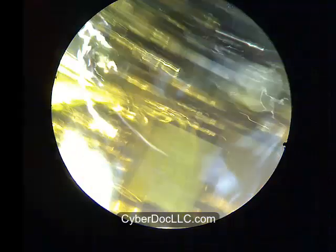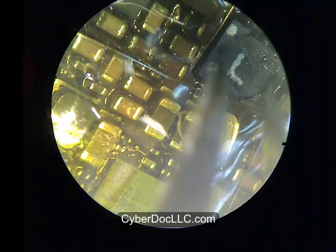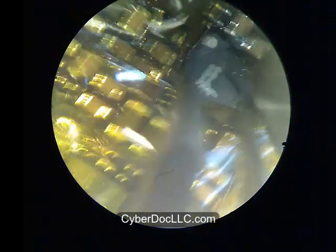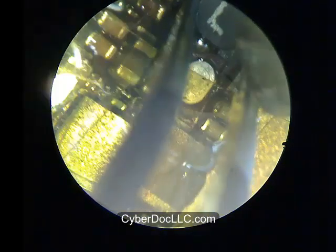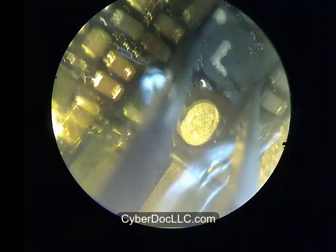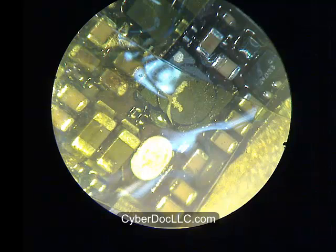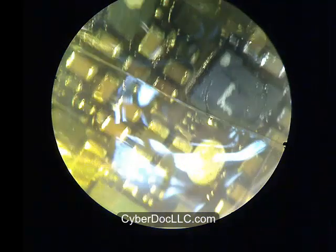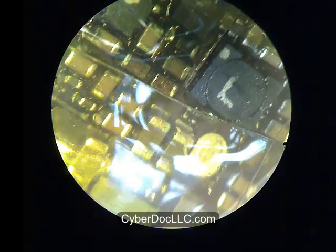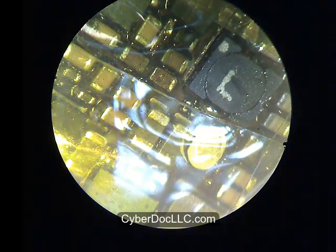Always supply flux. Once the flux is dry, you are running dangerously at higher temperatures than you want for the solder to flow, getting into the range of damaging neighboring components. Flux serves almost as a temperature buffer to absorb excess kinetic energy from the heat gun, so the temperature will only rise as high as the flux vaporization point. For this particular flux, that vaporization point is just a few degrees above the lead-free solder melting point — it will vaporize at 270 degrees Celsius.